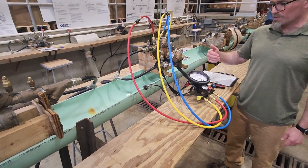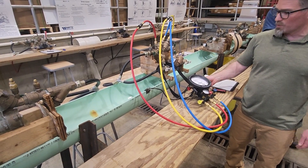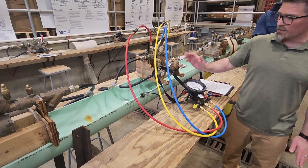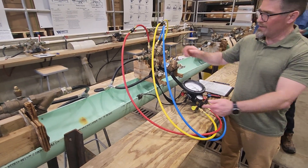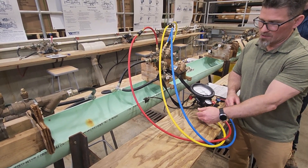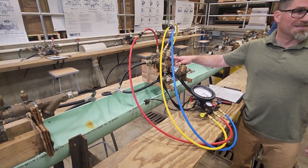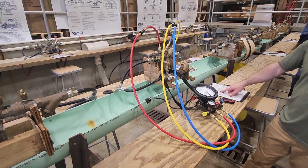To reestablish the zone, we need water to come out of the zone — that is connected to your low side bleed. Open the low side bleed, needle comes all the way up, then close it. That resets the zone. I'm back at 9.2. Once it's steady, now I can apply the back pressure and see if it gets past the check. Open the bypass valve — give it a good couple of turns. I'm now applying my higher supply pressure behind the check. My needle is not dropping, so it tells me it's stopping right there at the check — it's not leaking. Check that box for closed tight.